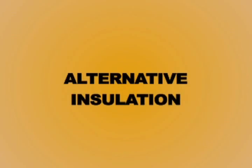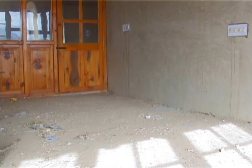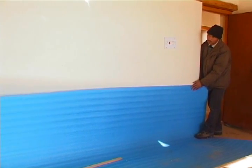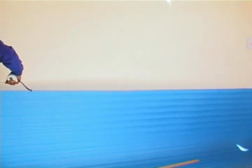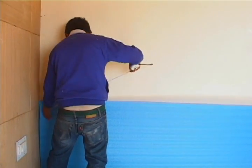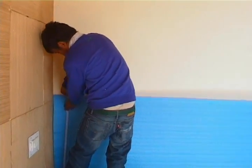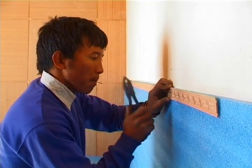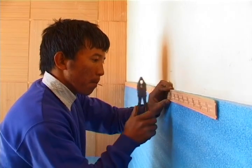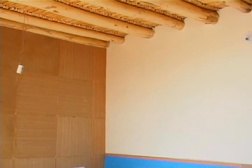The partitions made earlier will prevent the mud layer from cracking. If it is not possible to make the floor anew, you can prevent major heat losses by applying a half-inch thick layer of foam mattresses on the corners where the floor meets the walls that are exposed to the outside. The strip on the floor should be at least 3 feet wide, and the strip on the walls should be at least 2 feet wide. Fix the strip with a wooden batten and, if possible, cover it with plywood.